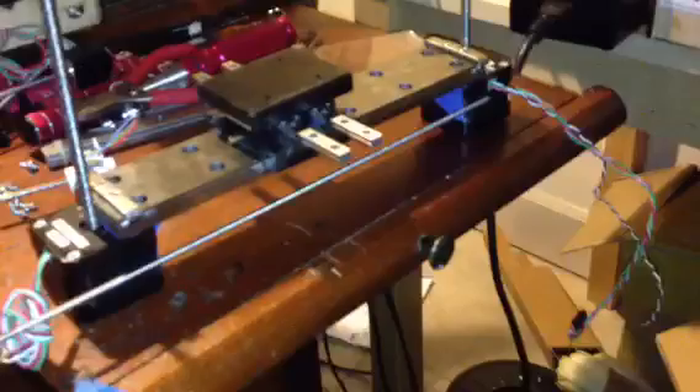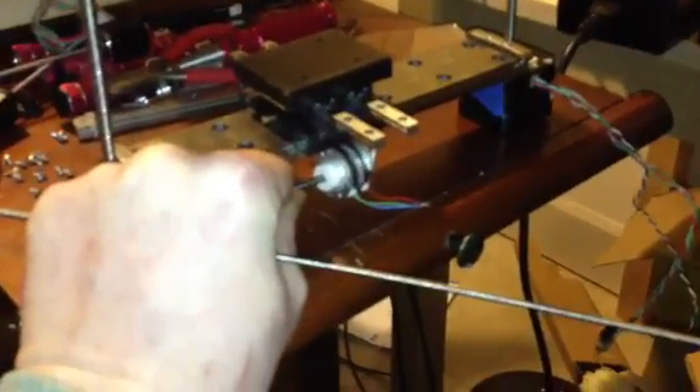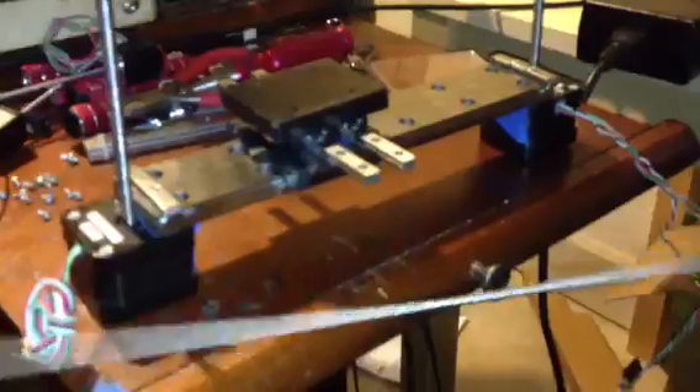It's super smooth sliding, and I'm going to use these tin can linear steppers for the actuators. They've got a lead screw going through the middle, and I have a couple of 18-inch lengths of the right size Acme screw, so I can go ahead and cut a screw that long. I'll mount the ends on the carriage, mount the little stepper motor underneath and attach it up here, so the motor will be stationary with the carriage and move back and forth on the long lead screw — same thing for this axis.